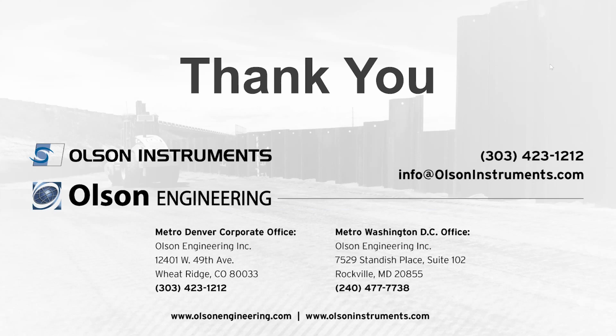Do you want to add something further to that? Yeah, so you will have to have a moisture content measurement in the field when you do the LWD testing, so that you know what that moisture content is when you're doing the testing. Oftentimes, immediately after compaction, you're doing that moisture content to ensure you're in the optimum range during compaction.